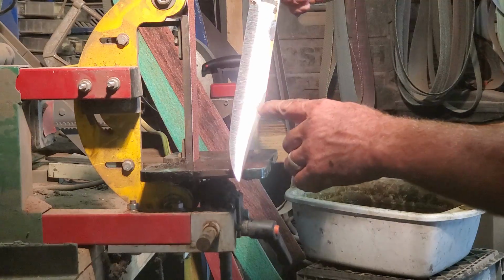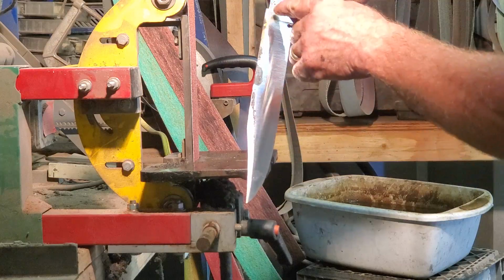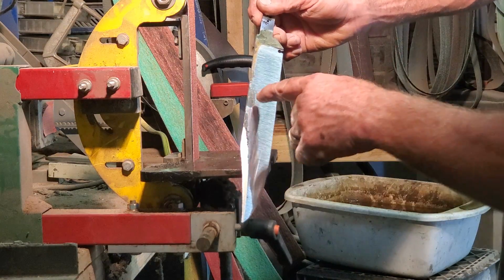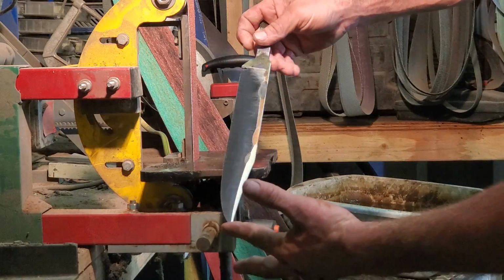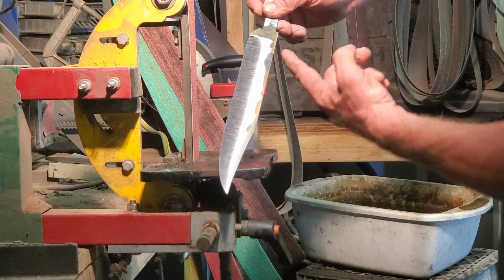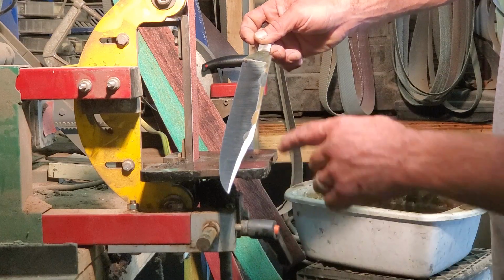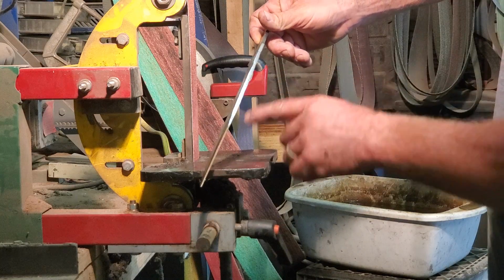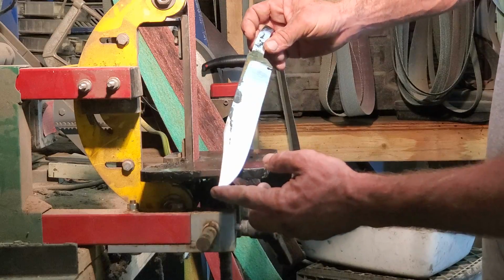And I decided that I'm going to leave some of the forge marks in this one in a few places, so it will kind of be a contrast between the refined look of the hamon and the rough look of the forging process. And part of that is a direct result of my shoulder injury. I can't control the hammer like I would like to, and this is a stray blow that goes a little deeper than I want to. I could take it out, but I think in this one, I want to leave it.